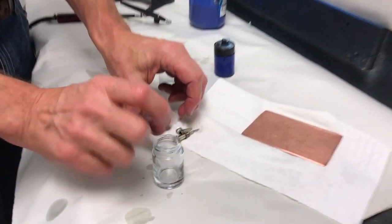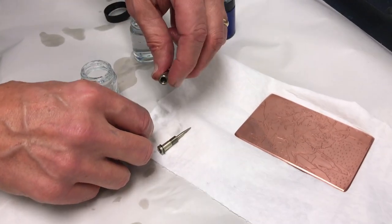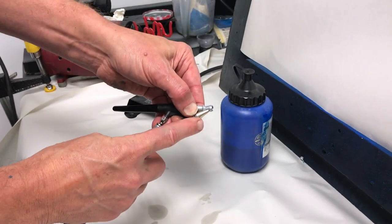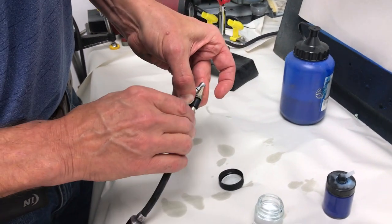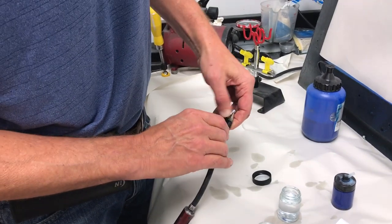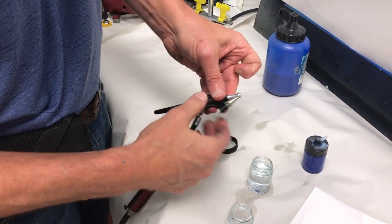The components are four. I'm leaving that little washer on the jet, the cone, and that nut. You take the nut and the cone and align them so that they're in the gun. This allows you to put the needle right through there and begin to seat it — push and thread it in. I keep them separated from each other, otherwise they'll lock on each other.